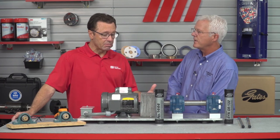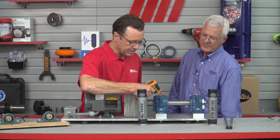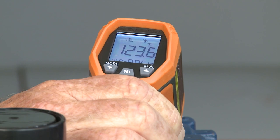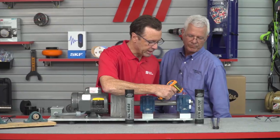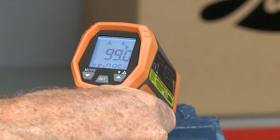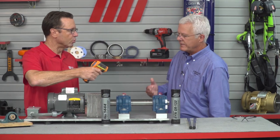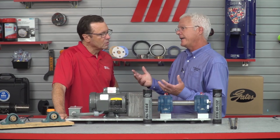We've got one demo left — the motor — but we need to let it run a bit. Let's turn it on and grab a cup of coffee. All right, let's take some temperatures and see what we got. On the 1444 I'm getting around 123, 124, 125 degrees. And on the SynGR 132 — wow — that's about 20 degrees less. I'm getting just under 100, around 98 to 99. You can really tell the difference. Imagine if we had a 3600 RPM motor — we'd have much higher temperatures on the bearing with 1444 and potential premature bearing failure.